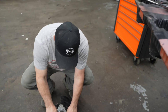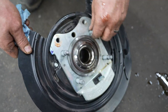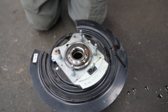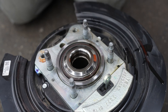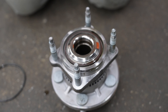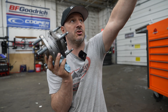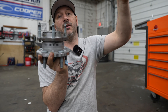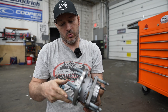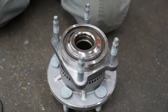Now down here we've got a bearing assembly. Kind of cool — we've got an O-ring right here. This is actually what's carrying the weight of the unit. Being that you could pull this axle shaft clear out of here and this thing could still be rolled around on its own weight, the actual shaft isn't doing anything but propelling the unit. It's a super cool design — a lot different than what they've run for a long time. I was curious to see what it looked like, and there it is.